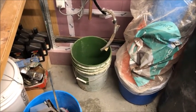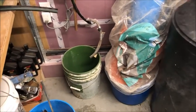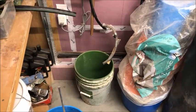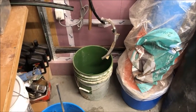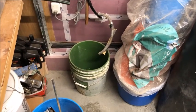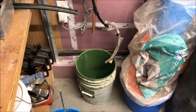The problem is that when it freezes, it drips into the buckets and the buckets fill up. I have yet to be surprised by overflow, but it's come very close numerous times. I tried last year to implement a water level sensor using Sonoff RF water sensors, but the probes basically rusted in the water, so they didn't make good contact anymore and didn't alarm me.